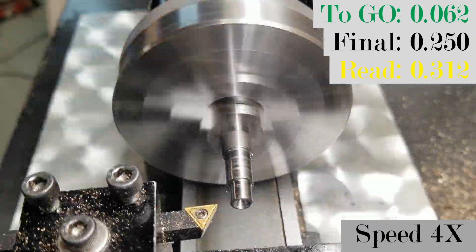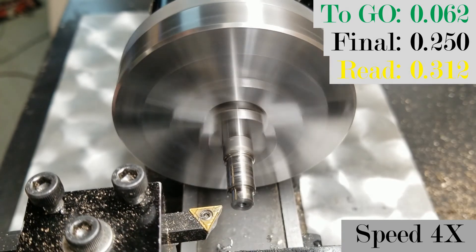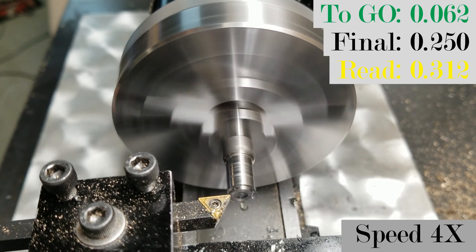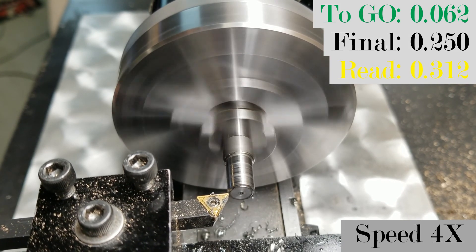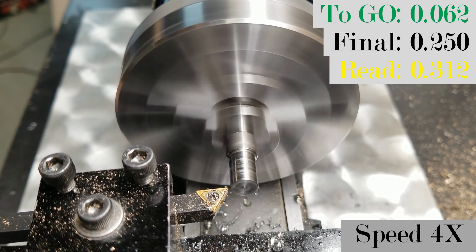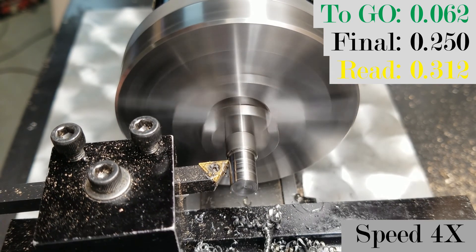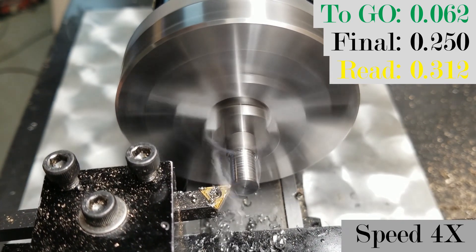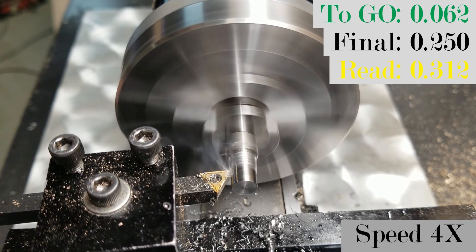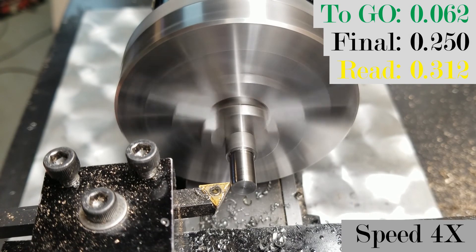Admittedly I've been struggling a little bit with my axles, particularly the ends. I can seem to do the first one but I keep taking a little bit too much off the bearing surface. So I've got quite a few scrapped axles — for those of you astute observers, you'll notice this one's a bit shiny on the inside of the chuck because I've been practicing and trying to figure out my speeds and feeds and dialing in.